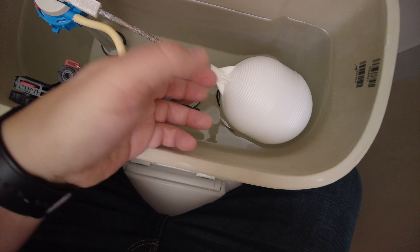Make sure you clean up any water that may have spilled — you don't want it sitting on the floor too long. Now that the water's out, it's also a good opportunity to clean out the tank. You can see this bolt here holding the toilet tank to the toilet itself is corroding, so I'm going to clean this up. Word of caution: the rubber might be deteriorating down there, and if it is and you clean it out, it could stain a towel — so don't use your good towels.